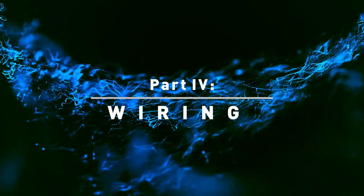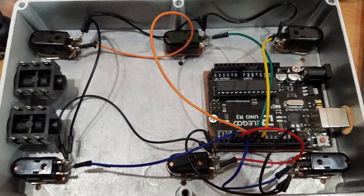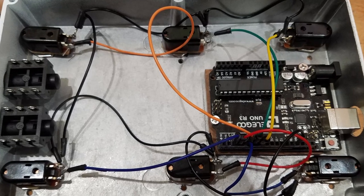The wiring is probably the trickiest part of the build, but it's both frustrating and kind of fun at the same time. You will be doing a lot of soldering, so I hope you know how to solder if you want to do a project like this. Each button has a positive lead and a ground lead. I color-code the positive leads to make them easier to find and keep me from going crazy during the process. The ground leads are a big daisy chain of breadboard wire connecting them all to a single ground port. I used breadboard wire for everything in this project, but it would be a little cheaper to use stranded wire for most of the daisy chains.